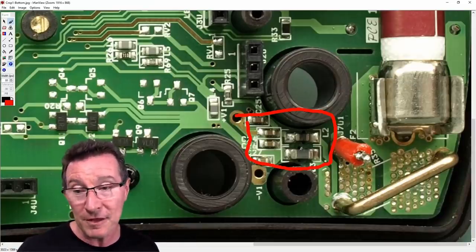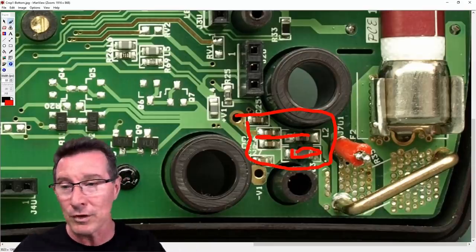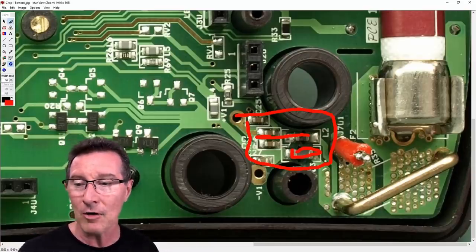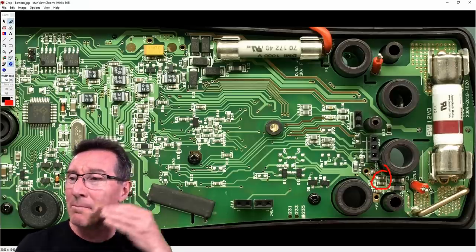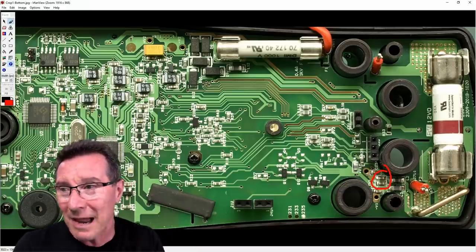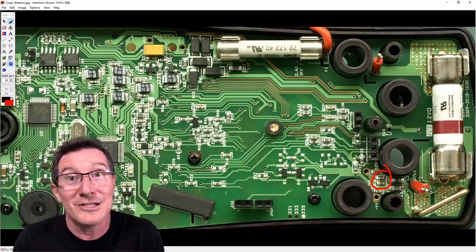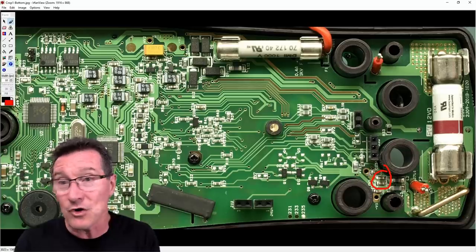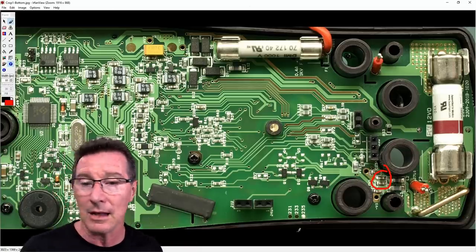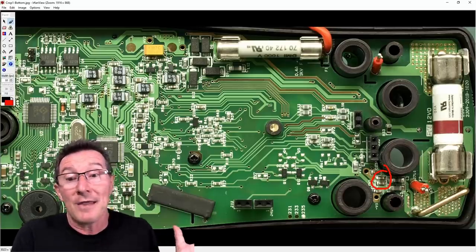They're not the greatest things at the best of times. Maybe there's some board flex in here. In fact, this meter actually did have a video a long time ago — there were board flex issues in this area, with breaks in the inductors or something. That's not related to this battery issue, because even if these inductors break, your grounding's completely ruined and all your measurements will be off — that's got nothing to do with battery consumption.